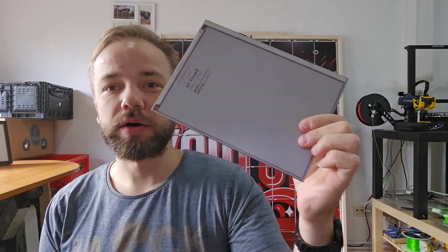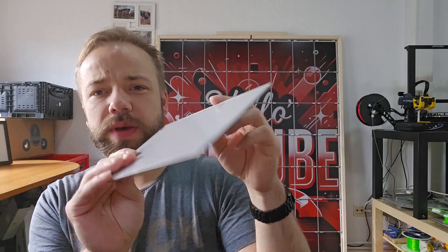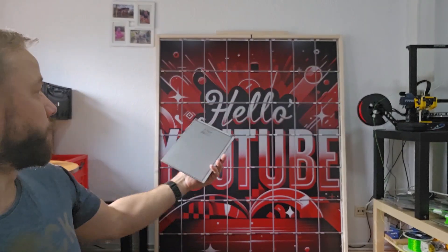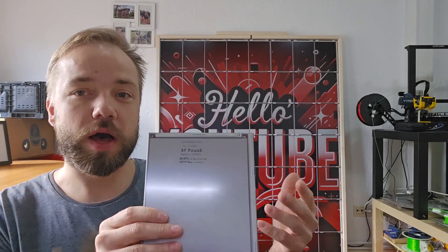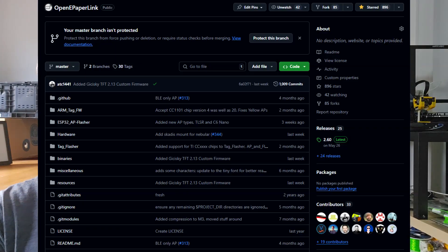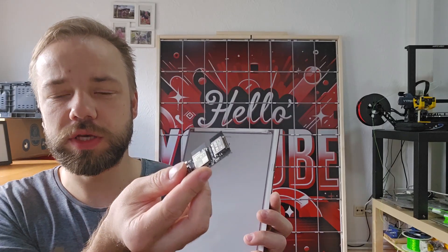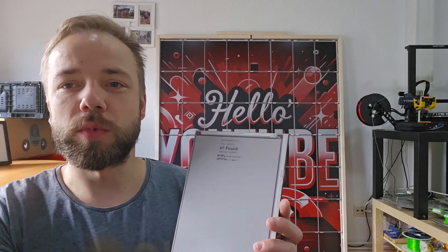Now the new one is made out of 56 9.7 inch displays — the bare display with a DIY PCB on the back, battery driven, and installed on the wall as you can see here. Everything is driven by OpenEPaperLink and it is currently controlled by an access point featuring an ESP32-S3 and a TLSR chip, so it's quite small and versatile.